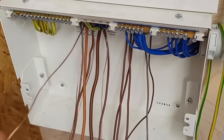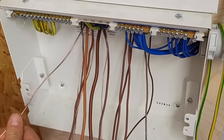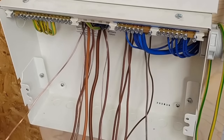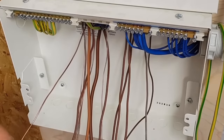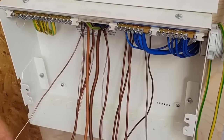Well, we're in the day and age now where the internet's around and it's quite easy for a customer to go out and get himself a light fitting from John Lewis or IKEA and stuff like that. I don't know if you've seen the back of an IKEA light, but it's definitely not three plate. Sometimes there's not even enough room to get all the cables in there. There might be a very small 16 mil grommet. There's no chance in hell you're going to get three twin and earths and twin and CPCs in there.